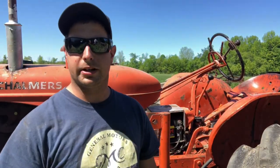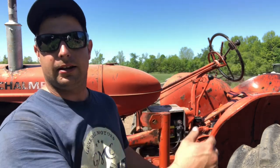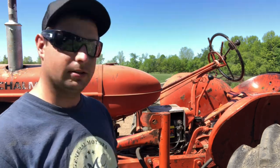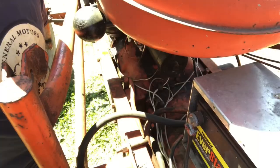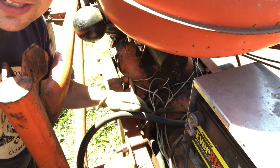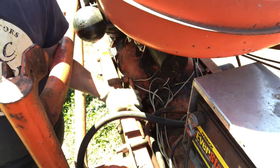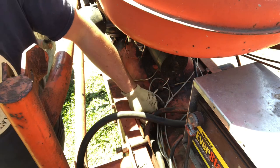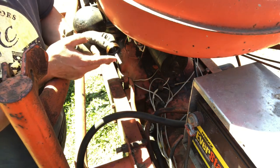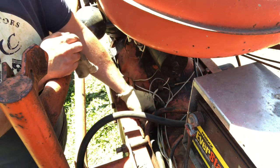The next one we're going to check is the hydraulic fluid, followed by transmission, rear end, and then the final drives. I'll get the camera repositioned so you can see it. That's your hydraulic check right down here. You want to check that with the arms in the air, which mine are right now — those are the lift arms on the back. You've got a low and a high with rams extended. Our level is good, so that's your hydraulic oil.